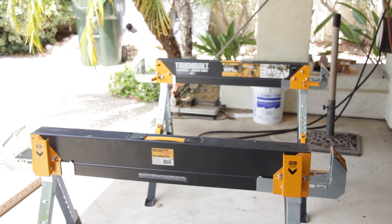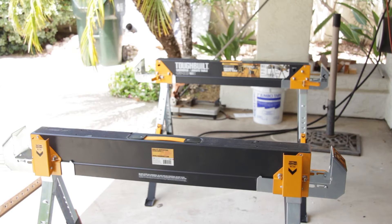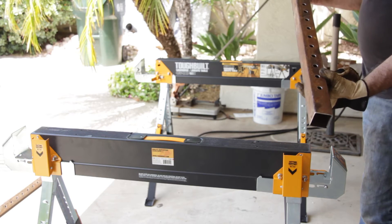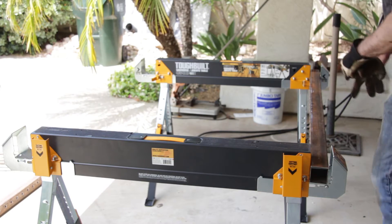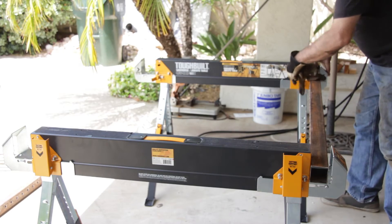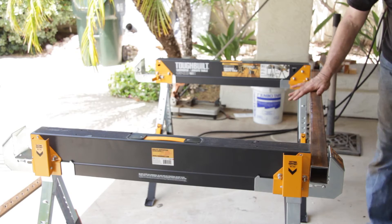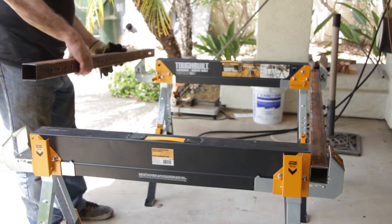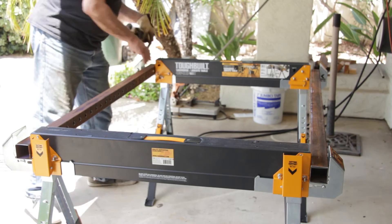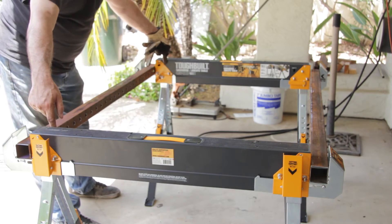I bought some rebar at about twelve to fifteen dollars, so not too expensive, and it gives me pretty much a 4x4 sheet I can put in there for cutting. The rebar is used for the sacrificial supports that can be replaced when the plasma cutter tears it up. What I did was drill some half-inch holes evenly spaced about two inches apart so I can place the channels in, slide in the support, and then lock down on the sawhorses.